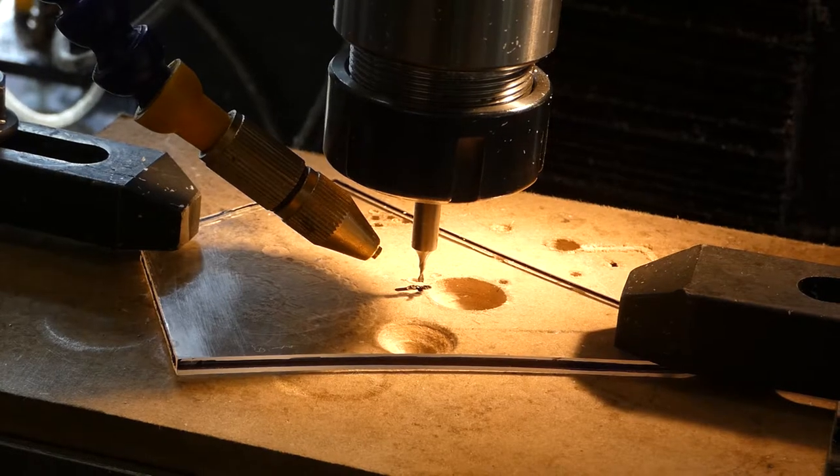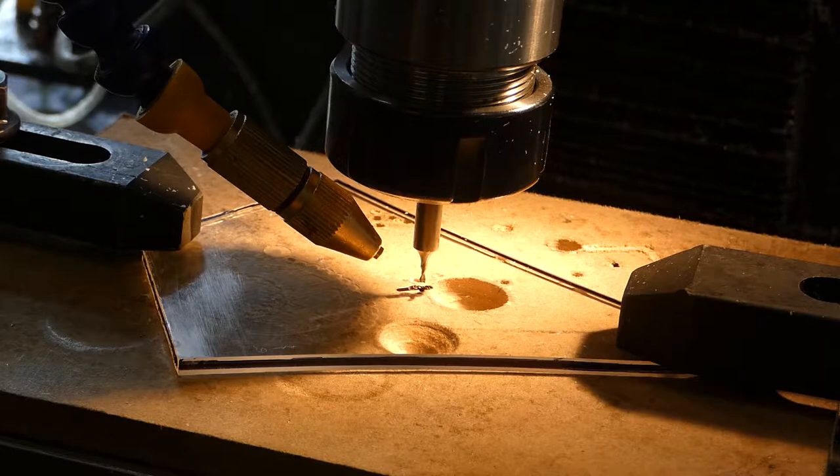Right, having done that, this is the setup. At the moment it's a 1.5mm 2-flute cutter. The main problem with cutting acrylic is that the swarf that comes off will cling to the cutter and rapidly turn into a solid, hard, rock-like lump, and you've lost the cutter in a matter of seconds. So you've got to get rid of the swarf. I don't actually need a coolant, so I've got a jet of air which is only about 5 psi — nothing high pressure about it. It might help to cool the cutter down a bit, but it does the job.